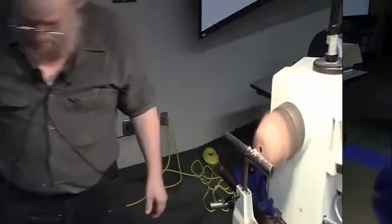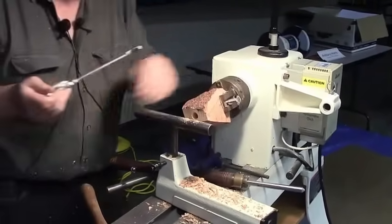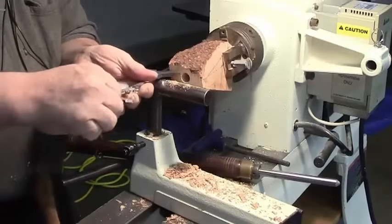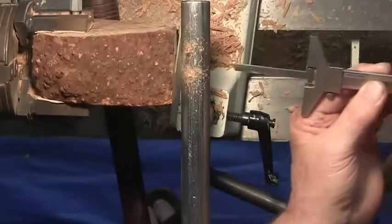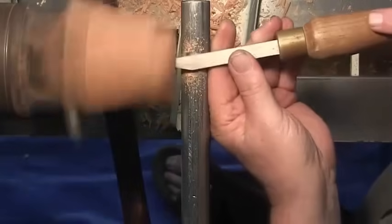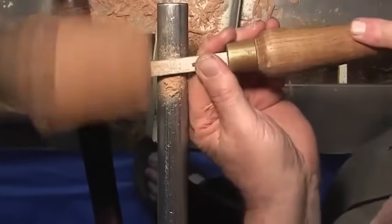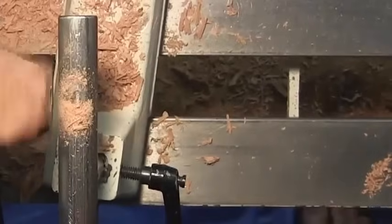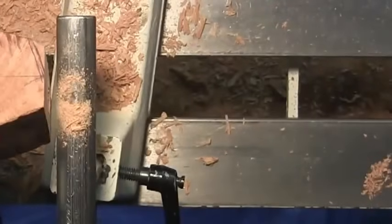The law is you can't make the inside bigger than the outside, and to avoid that you have to measure stuff. As I make this cut I'm bouncing up and down — what it does is give space for the tool and lets you bore a hole. Normally people use spindle gouges to do this. I use a half-inch round nose scraper. I've always been a box maker — boxes are probably the most common thing I make, and this is a box: I'm going to cut a chamber and screw a lid on it.